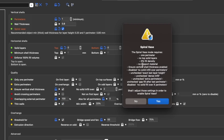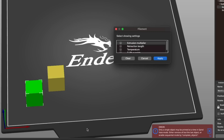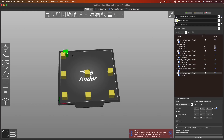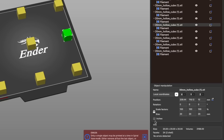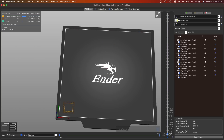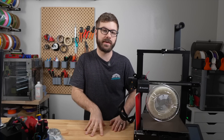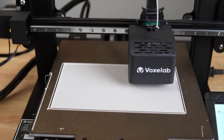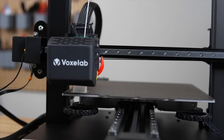To do this, I downloaded the cube STL linked in their guide, removed all the bottom layers, and ran it in vase mode. To expedite the process, I used SuperSlicer's per-model settings to increase the print temperature for each cube starting at 200 in 10 Celsius increments up to 280 Celsius. Since I was running vase mode, I also enabled complete individual objects so that an entire cube was printed and completed before the hotend raised temperature and started on the next cube. Speed-wise, your mileage may vary, but ColorFab recommends not going above 40 millimeters per second. I did attempt to go above that but ran into issues with the filament not expanding quickly enough, which led to under-extrusion, so I would recommend starting there.